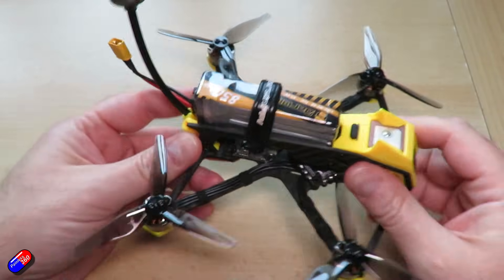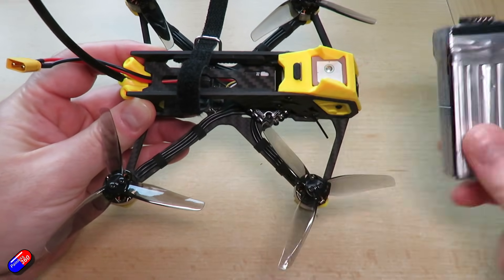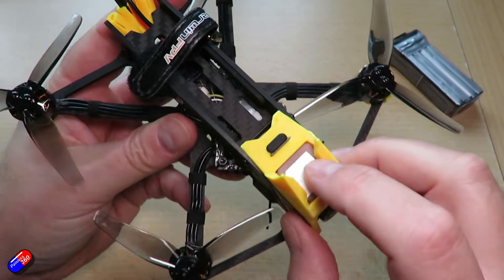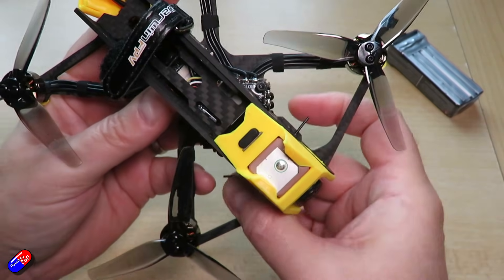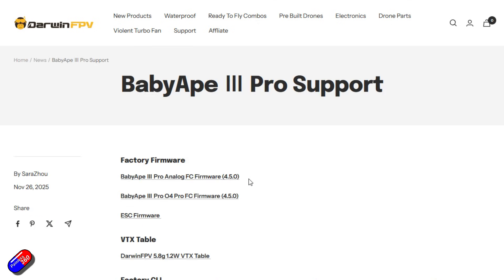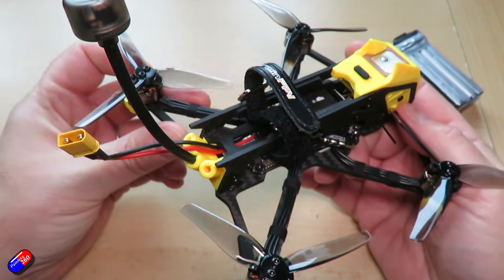The challenge is it's really designed around these specific batteries that go in between — there's a channel on top built for these 850mAh 4S Darwin FPV batteries, though you could fit others without a problem. I love the fact we have GPS — I wish more quads of this size had it. It gives us Betaflight rescue mode which most of the time will bring it back if something bad happens, far better than nothing. If you're putting HD FPV systems in a little quad, you want a decent chance of getting it back if the FPV image fails. There's also lots of detail and support on the website: CLI downloads, STL files to print, and spares availability — they want you to fix and upgrade rather than outgrow it.